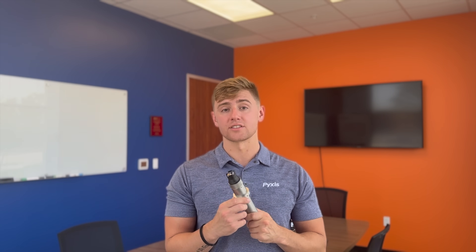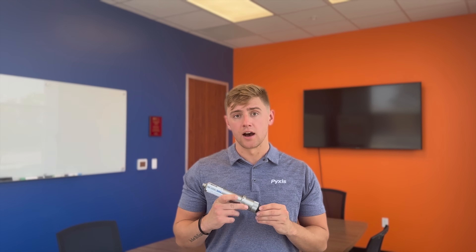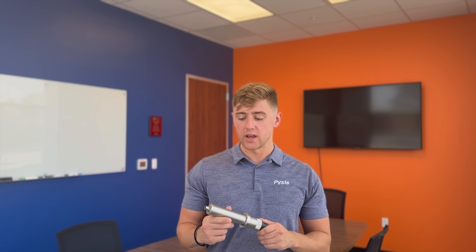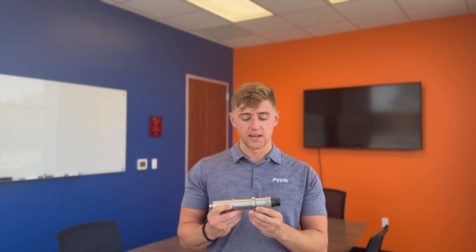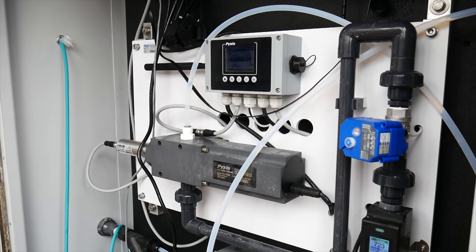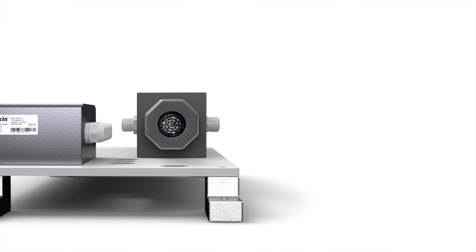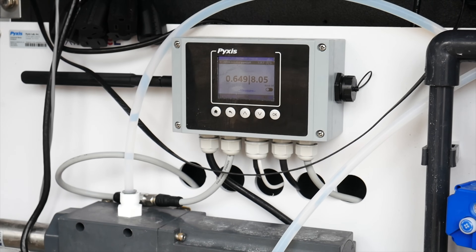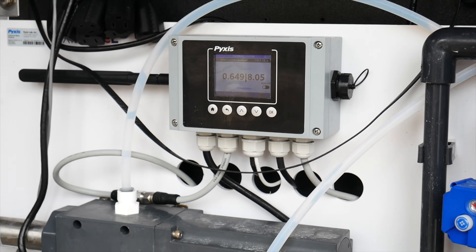You can quickly unlock and replace the sensor head every two years as the suggested lifespan, making it super easy to maintain and very cost effective. The biggest thing for our client and for us is to make sure that accuracy on oxidizer measurement is repeatable and consistent. We do that by installing the ST765 into an FR300 Plus flow reservoir, which has a motor-driven brush connected magnetically that cleans the head of the sensor continuously, allowing for repeatable accuracy and making the panel platform extremely reliable.